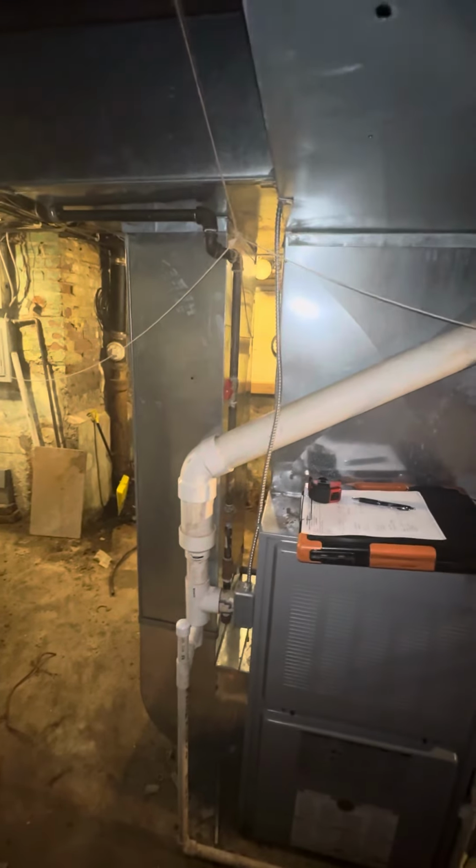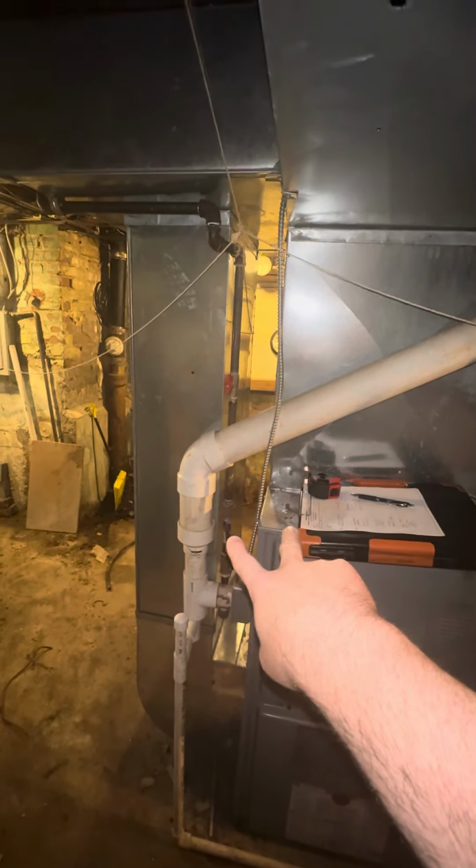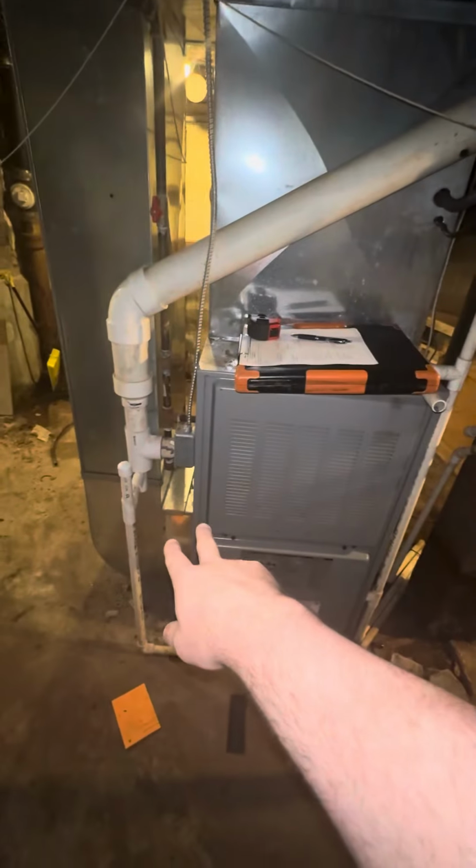Return drop is 66 tall. I'll get you guys probably 10 by 25. We got space. There's about 5 inches right now of a gap. We've got at least 3. We can move that over. We'll get a 12-10 in there.